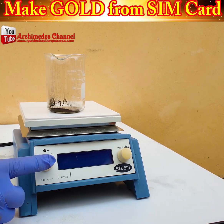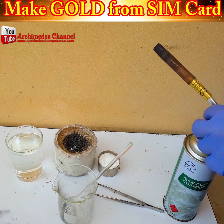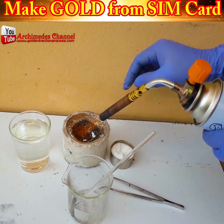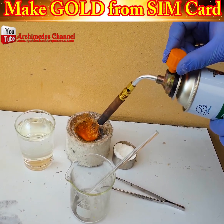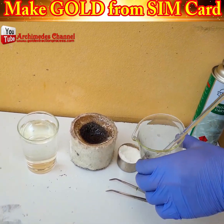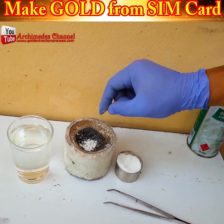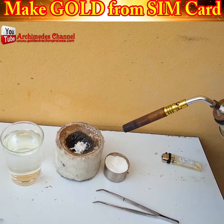On a low heat, dry it out. When you're ready to try to melt what you've got into a small cube, you can use some borax powder and sprinkle that over top while either using induction heating or a torch like this. It might take a few goes — a few rounds of sprinkling that powder on and sprinkling in your black gold dust — until the whole thing forms one solid. It took two or three rounds of heat and more powder, adding that gold dust, until, incredibly, it starts to solidify.